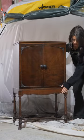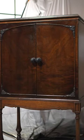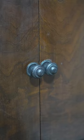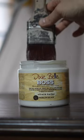I gave this furniture a gorgeous makeover and this is what I did. My friend actually inherited this piece and gave me the freedom to do what I wanted. So I filled in the deep scratches and then sanded it down to make sure I had a beautiful base to start with. I used some Pristine Clean to clean it because these pieces are very dirty, and removed the old hardware and got ready to prep.